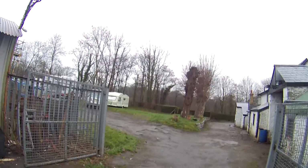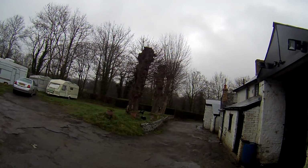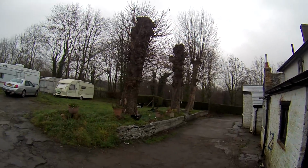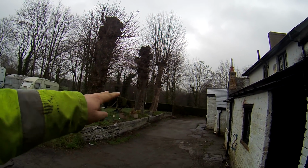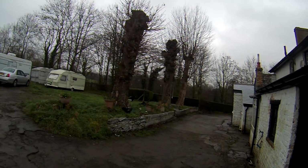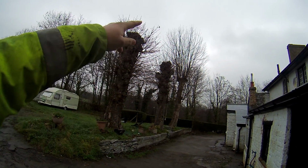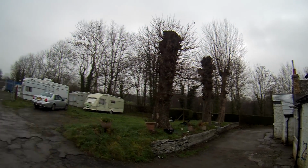Oh Kush. Them trees are coming down by there, so keep a lookout for them. I will definitely put scaffolding up. I'm taking them down in chunks, so I don't like how close they are to the house. And that end one is rotten, so we won't have a very safe hinge on it either. So look out for that. I'm going to scaffold up the inside, similar to that scaffold tower, out of the stuff I got in there, and then chunk it down. Take all the limbs off first with the pole saw from when I'm up there. Even them could fall over onto the road. And we'll do that. Definitely, that'll be soon, I will.